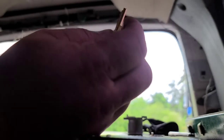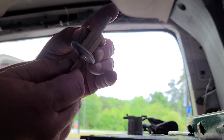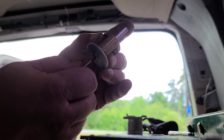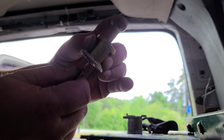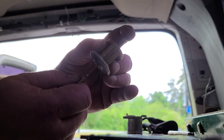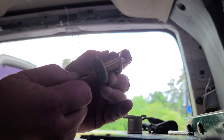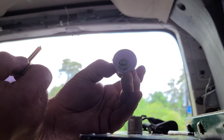I like to use a key blank — just go all the way in with the key blank, put a little pressure on the end of the shim. We look kind of back and forth, and of course the shim goes right between the two shear lines. If you get a little snap, that means you're probably using too much pressure. This shim has been used a lot, but in any case, now we've got the cylinder to turn — we'll just key it up now.